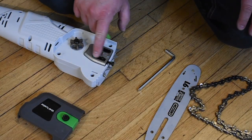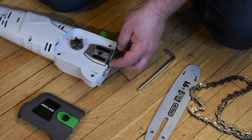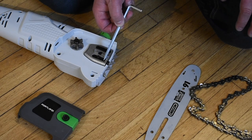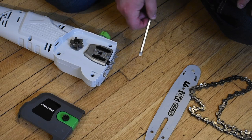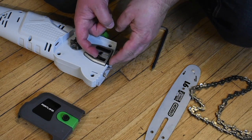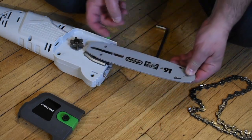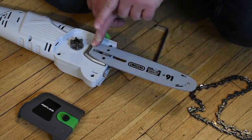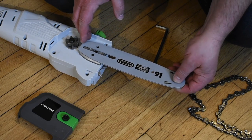Now, here is a little pin on the bolt. When you get it new, the pin might be here at the beginning. You want it more over to this end. The screw will push the pin or pull the pin in this direction. Then we move the blade into this direction, and the further it goes into that direction, the tighter the chain is.